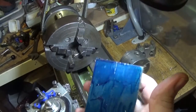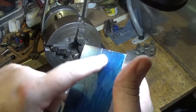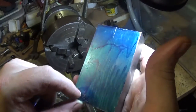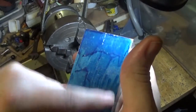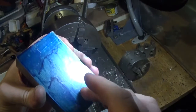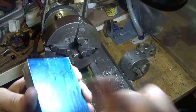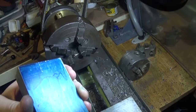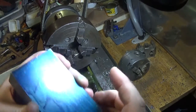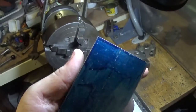The next job is to mark this out, put the top radius on, and mark the two holes. I'm going to leave a little bit on the bottom here to machine off afterwards. When I've got the hole bored I'm going to make a plug for that and set it up to machine the bottom off - that way we won't have to worry about it breaking through or squashing in and changing dimension.